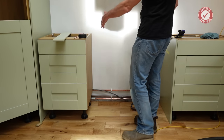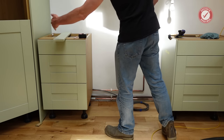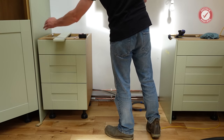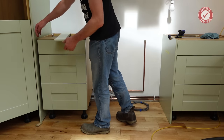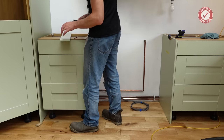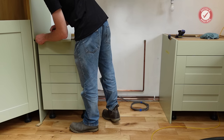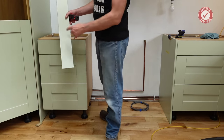I just wanted to show you this little bit here where the range is going because it's quite interesting. Basically, to get the gap right there's an end panel to go on here, but to get the gap correct we need to shuffle this unit along just a tiny little bit. That means we need a filler piece down that end. So we might as well get that filler piece put in now and then we'll do the scribe of the end panel for this unit, because this filler piece is going to set the distance. So I've moved this unit along a little bit. All I need to do is just measure this gap here — take off about 3mm to allow for a gap down that side. So we are looking at 31mm, so 28mm down that edge. One of these little filler strips needs trimmed down to 28mm.